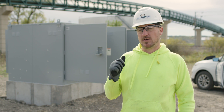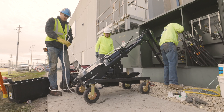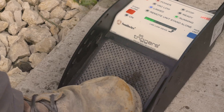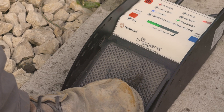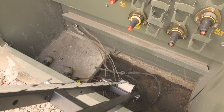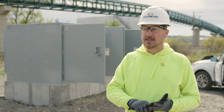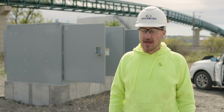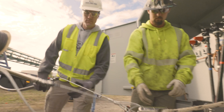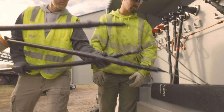The equipment we used today was our XD10, which is a 10,000-pound tugger, an XD1, which is a 1,000-pound tugger, our Maxis triggers — which are safety devices, foot pedals that are used on both ends of the pull. We used our quick ropes, which is a poly rope, low-stretch rope. We used quick links, which are used to splice two ropes together. And then we used our Slide-It, which is a large synthetic mat used for various things — sharp edges, helping guide the wire into the conduit.